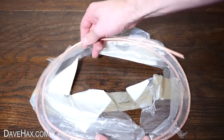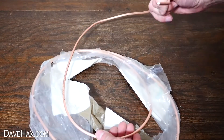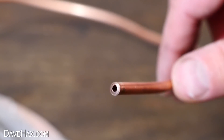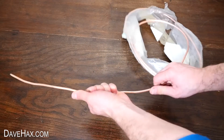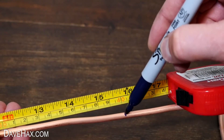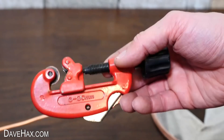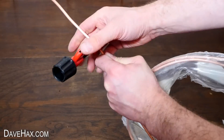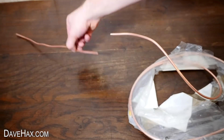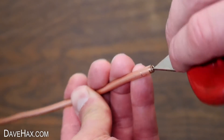I'm going to make a small putt-putt steam engine to power the globe, made from copper pipe which is 3 sixteenths of an inch in diameter. I straightened it out, marked a length 40cm long, and used a pipe cutter to cut it to length. I also deburred the inside of the pipe.